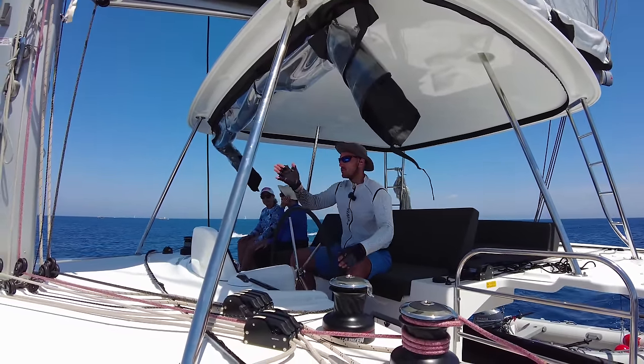Then we have this one from Victron Energy. Basically it's from the solar panels, but we connect a generator. So the generator would have its own panel, but we can control everything from here. Right now you can see that the solar panel is producing 280 watts, and the load on AC is 42. We don't see the load on 12 volts, but we can see we're charging with 1.6 amps.